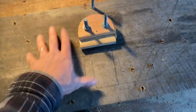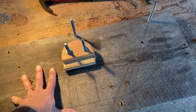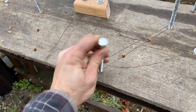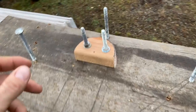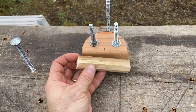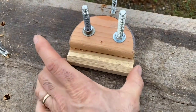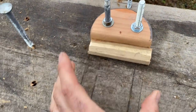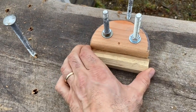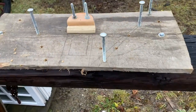In order for this to work, you have to have it mounted really solidly. So we'll take a look at that and then take a look at making the bow. I've got some bolts — just using these as pins. I've got three ready so that I can pin it over. You also need just a small stick the width of the bow — so this is a four-inch bow, this will go under here. As we bend it around and tie it off, this will keep that radius the right width and give it some strength until it sets and dries up. Have some string to tie it off and some gloves, because we're going to be taking it out of the steamer hot.